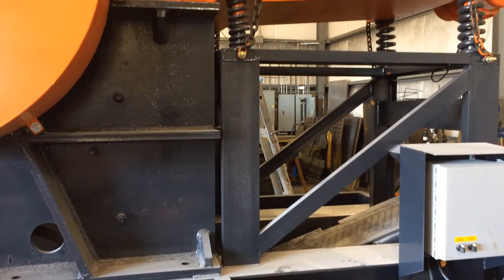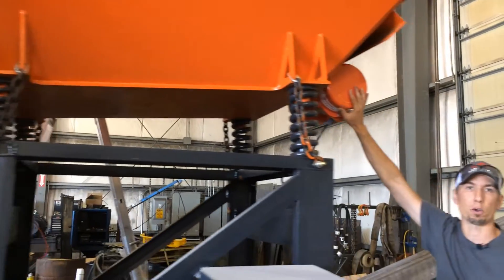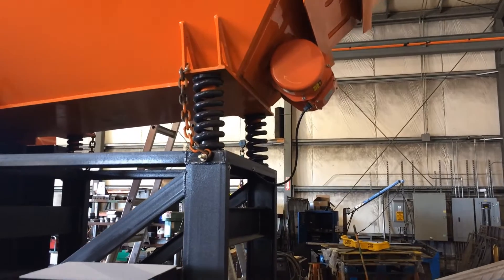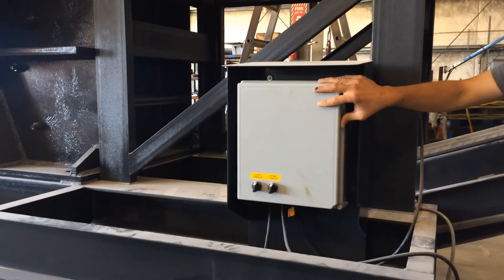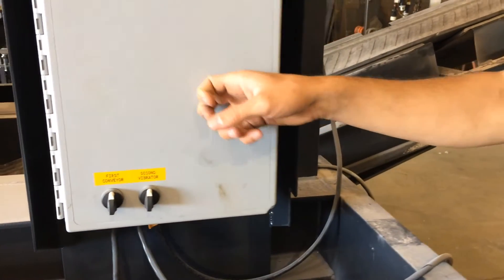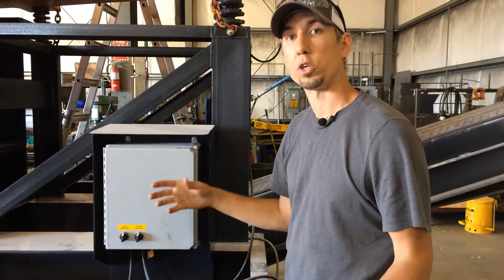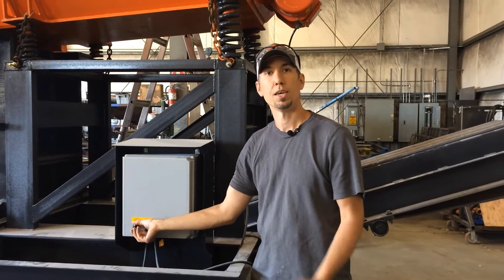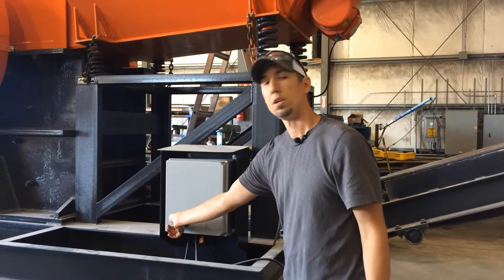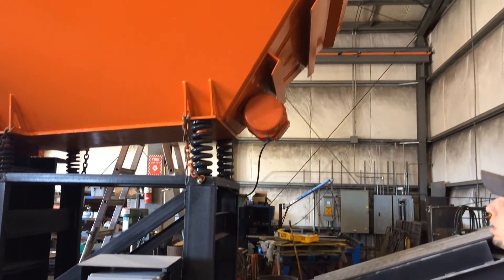Because this is going to a place where there isn't any three-phase power, the customer is going to run the two electric motors — the one vibrating motor here, which is 1.5 horsepower, and then the 2 horsepower conveyor motor — and both are still three-phase. So we've actually installed a phase converter here, so that he can run off a single-phase 220 volt generator that you can buy at any hardware store. You put single-phase power into the phase converter, and it generates three-phase power to the two three-phase motors. This phase converter is rated for two to five horsepower, and that's important because you have to turn on the conveyor first to get enough power being used by the phase converter to then run the vibrating motor. You can't run the vibrating motor first — you have to turn the conveyor on first, and then the vibrating motor to vibrate the hopper.